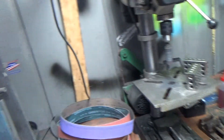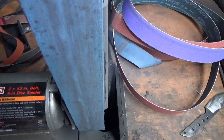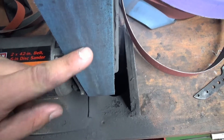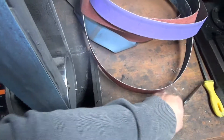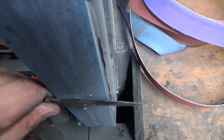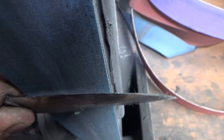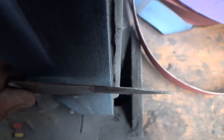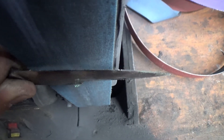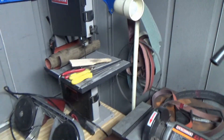One of the most important things to light up is your grinder. So when you're standing over it right here, this is your view from when you're grinding a knife — you need to see right here. More specifically, this is my old shop knife — you need to see that area in between the blade and the belt. So that little area right there. Whatever it takes, get some lighting so you can see that space. It'll help you with your grinds immensely. If you can't see your grinds, you're going to screw them up.